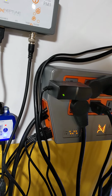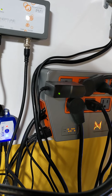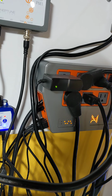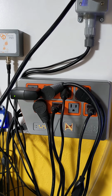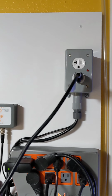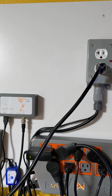And what I'm going to be doing is making 2 of these per EB832, and I'm going to run them off the 24 volt accessory outlets. So in effect, I can change my EB832 into an EB1032. And then I'm going to run my heaters off of there. The other ones, well, like I say, you can have 2 outlets, but you're going to be able to have them all on or all off, which is fine.